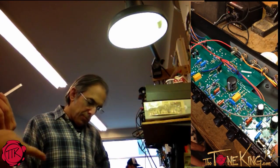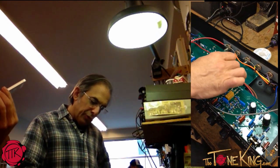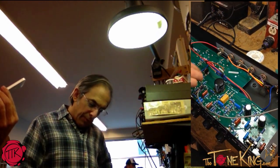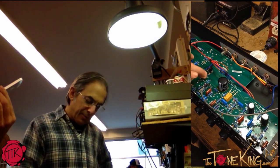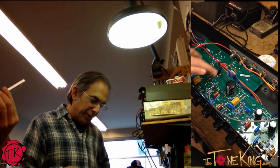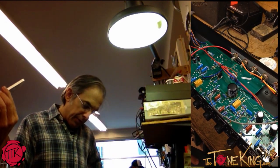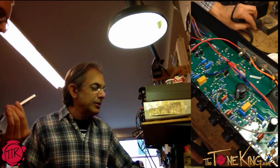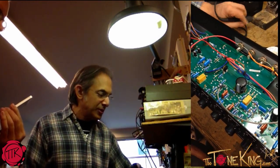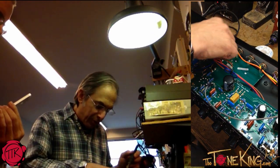How many parts are you going to change on the PCB to enable the output change? Hopefully only three. We may have to change two different resistors in the bias supply, but generally my experience with Jet Cities has been that I only have to change one of the resistors. It's one of those things where you have to plug it in, test the voltage, and then adjust the resistance value to suit, because it's always a little bit different.